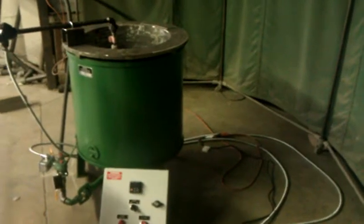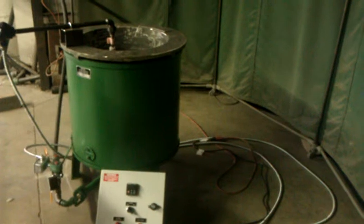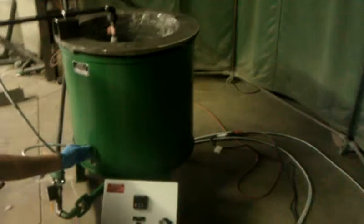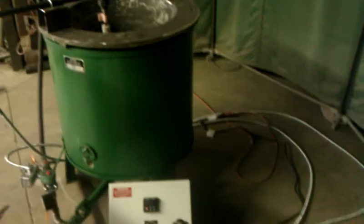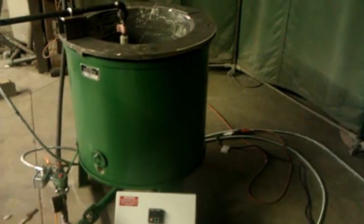The purpose of this video is to show you how easy it is to operate a number 1000 soft metal melting furnace. First, light the pilot. Open up the pilot lighting hole. The pilot's located on the inside. Using a plumber's torch, you're going to light the pilot.